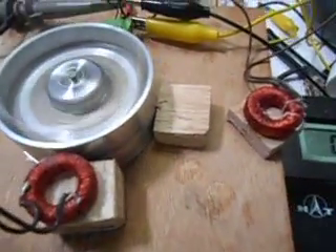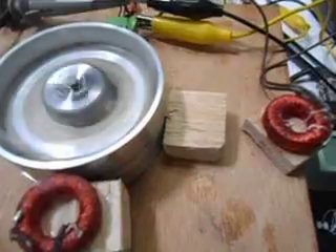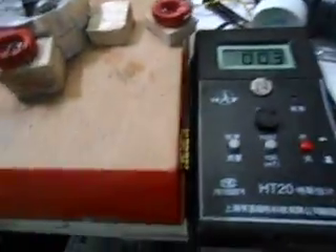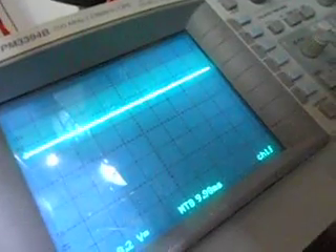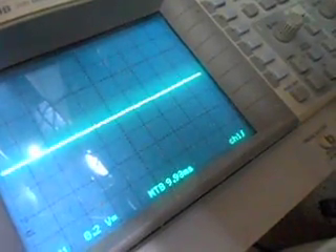Let's bring it back down to 4 volts. Just to show you how it works — when it goes low there, that's when the coil is on and masking. When it's high, that's off. Right there is where it is, it goes by this way. It's masked right to there, then it gets unmasked right there. It comes in here and it's sucked in by the toroid. Right there it gets masked, and from then on it coasts on through until right there.